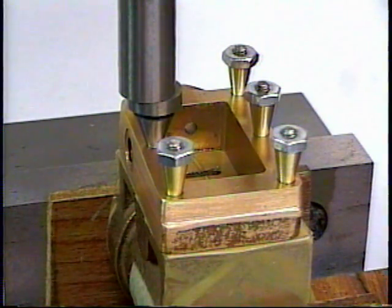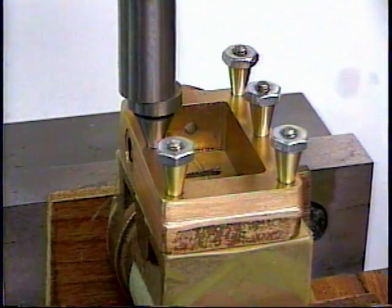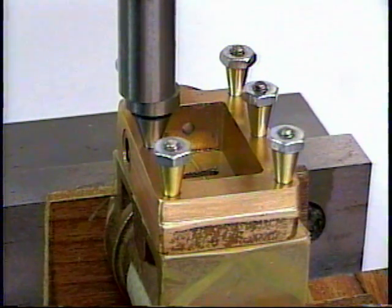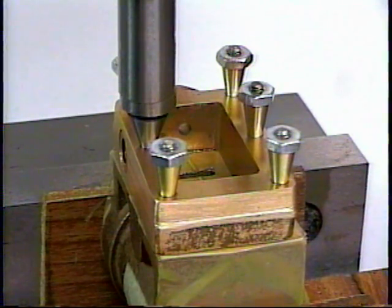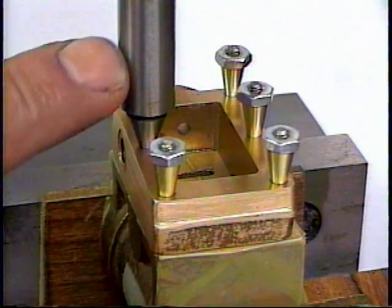We're locating where to drill valve chest mounting hole number 6, and we're using the conical tipped edge finder, which is mounted in the milling machine chuck, and the tip of the edge finder engages at the center of the hole. Now we can see we're not lined up, but when we are lined up it will look and feel like one piece is there. And I'll reach in and I'll feel that.